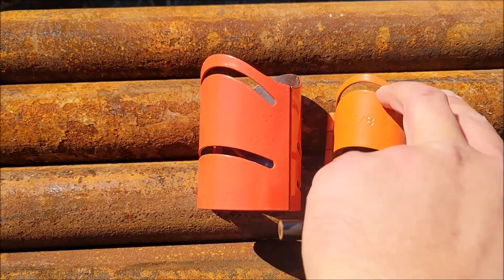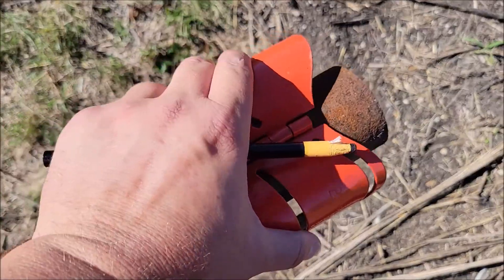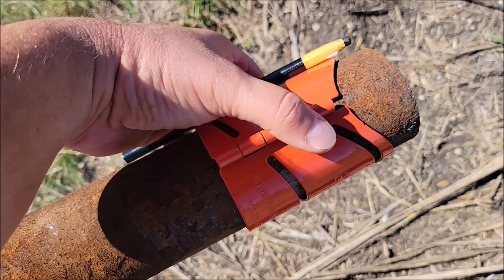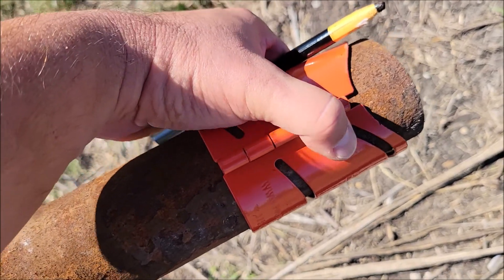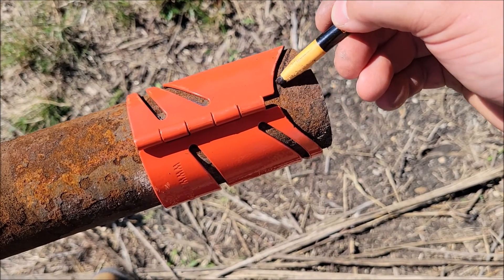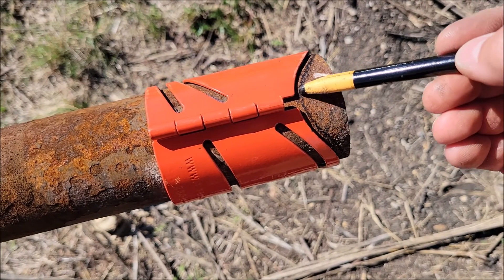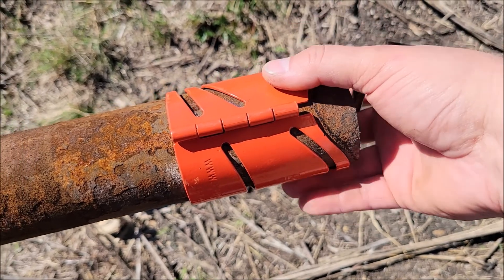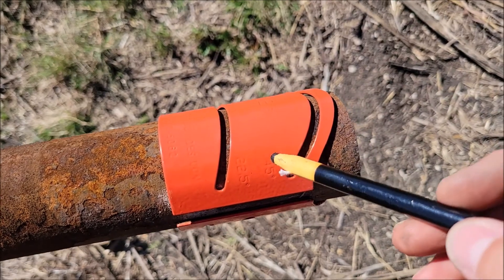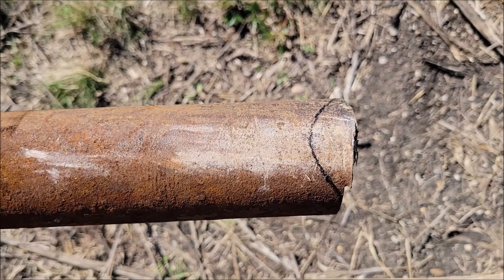Today I'm using this pipe size, so let's talk about this template here. First thing I do is put the template over the pipe — they're magnetic, so when you close them they stick to the pipe well. I try not to waste much pipe, so I get real close to the edge and make my marks from the template. I do this on both sides. The top part is for a good saddle cut, and these other cuts tell you right on the template — this is a 45-degree cut, this is 22.5 degrees.